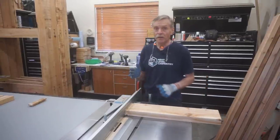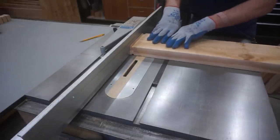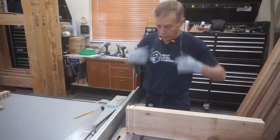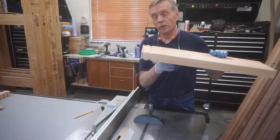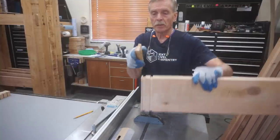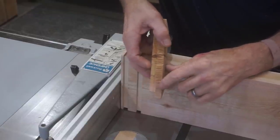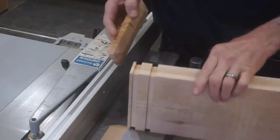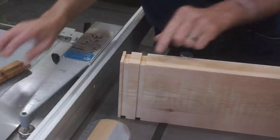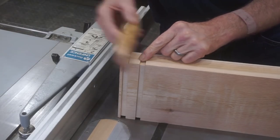With that rant out of the way I'll move the fence over one and a quarter inches and repeat this dado process with a fence setting of one and a half inches. It's important to note that based on the shape, angles, and design of this plug the space between those dados is enough for the top half of the plug. This lug right here is where the top part of the pyramid cap gets cut out of. Moving the fence an inch and a quarter at a time leaves enough space between the dados to cut a complete plug in between — which is the second half of the magic for making these pyramid caps.